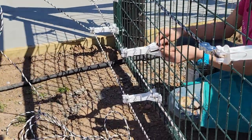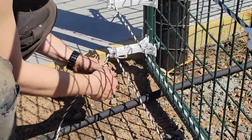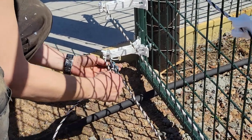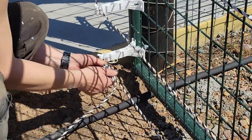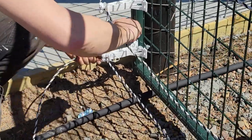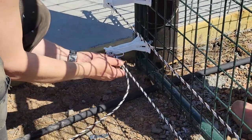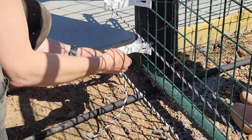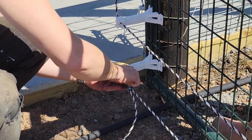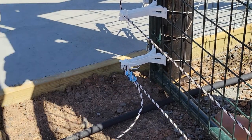That just allows you a little more mobility. If you're going in to feed the pigs and they want to bum rush you, don't turn the fence off. Open it up with the fence hot, and when they push into you, get out of the way and let them bump the fence a couple times. They learn real quick not to come at you. All I'm going to do is put the splicer on — it's just two nuts that clamp down. I cut off the extra Intelli rope and this gate is pretty much wired up. I just have to put the main leads from the switch in and connect it to the fence. Simple as that.